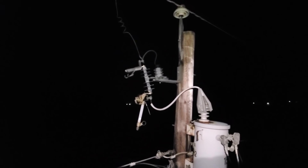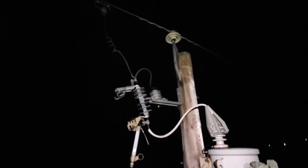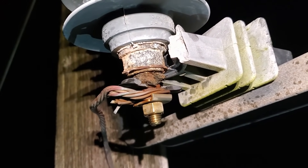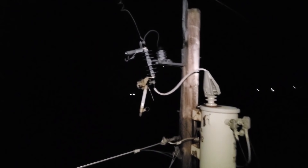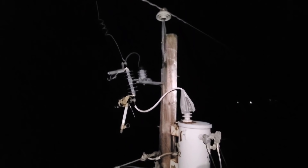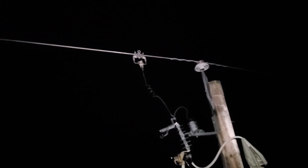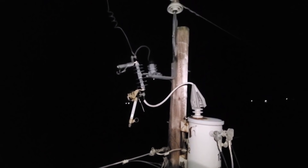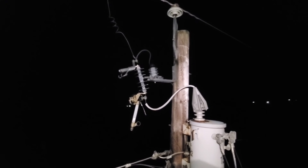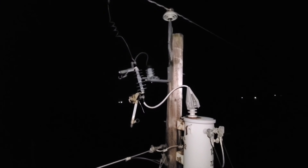Huge hazard here that would have been easy to miss — you see that lightning arrestor right in the center of the screen? It's actually completely broke off that bracket. From here you can see it's a little lopsided, but the fuse is blown. Our next step would be to remove that tap clamp. We're actually going to change the switch, lightning arrestor, and transformer. While trying to get that tap clamp off, it's going to be shaking things around — good chance that lightning arrestor might fall off. So we've got our hotline cutters here, tested, and we're going to just snip that clear first thing and put a new lead on.